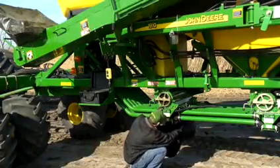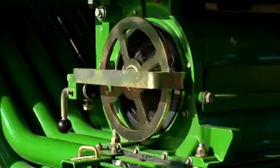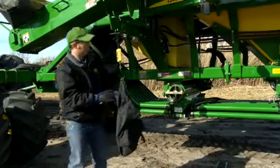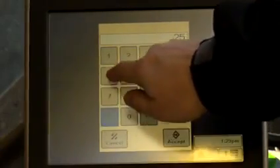Reinstall the calibration bag and select the continue button. Activate the calibration switch and hold until the meter stops turning. Hang the collection bag and weigh the product. Enter the weight of the collection bag into the weight box, then select Accept.